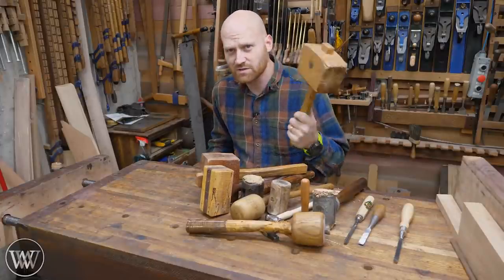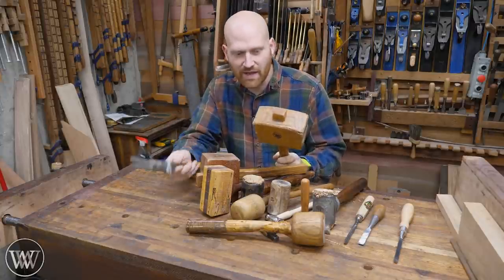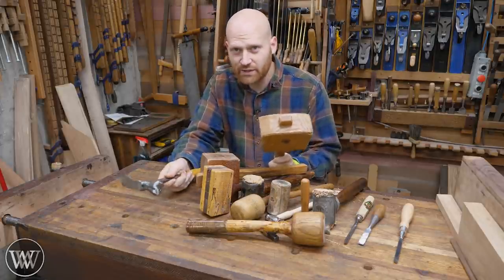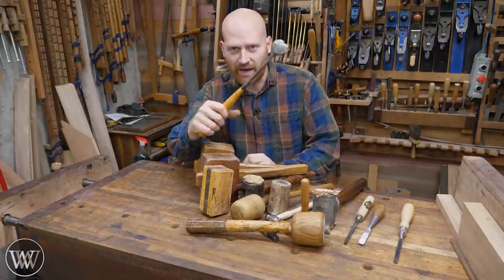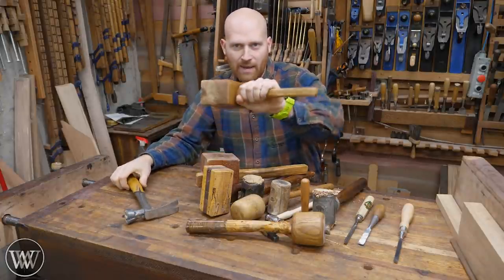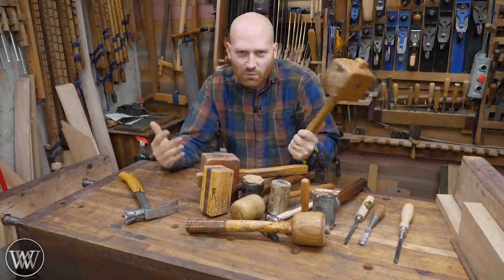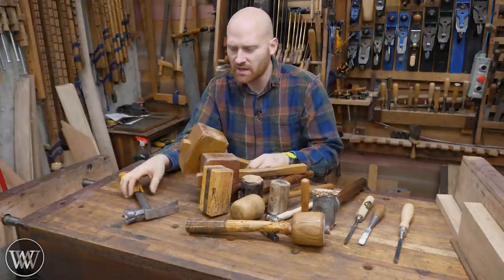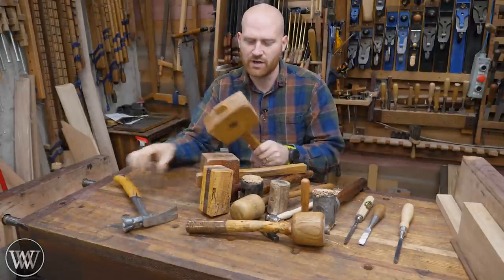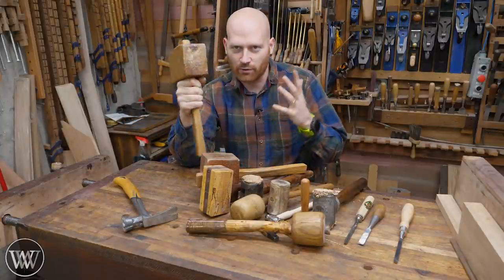So a lot of this is going to be my 'what works for me,' but it may or may not work for you. I'm going to go through the mallets I have and describe when I use them and what might work for you. First off, what's the difference between a mallet and a hammer? Most of the time a hammer is made of metal and a mallet is made of something else, but that's not always the case. For me, usually the biggest difference is a hammer you hold back here — it's meant for an impact at a distance, you get more leverage on it. A mallet gets held up here. If you hold a mallet back here, it becomes a hammer. Hammer is for force, farther back and leverage. A mallet has a little bit more control and is a little bit less about the force — you choke up on it, you hold it close to the head.